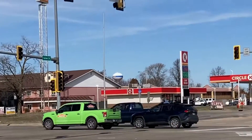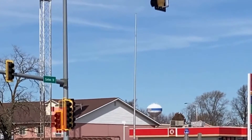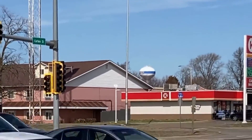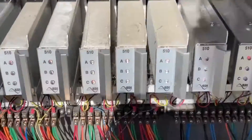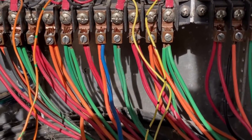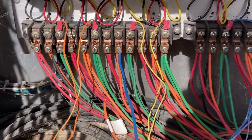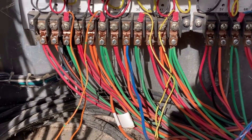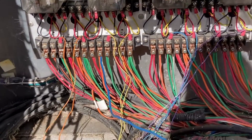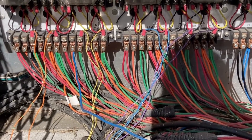Over on that far left turn three-section head, the agency went up and terminated the blue wire for the yellow indication over there, so the output of that yellow indication on the blue wire would then go over to the terminal block for that yellow arrow on the far side. Once they did that, it's been running fine — we'll know for sure whenever we have the next big rainstorm.